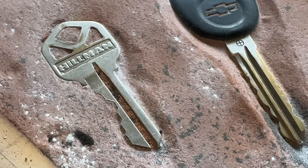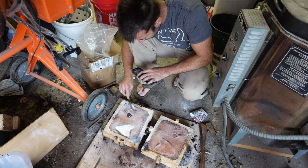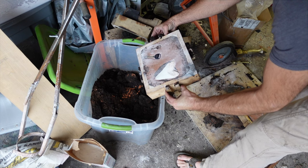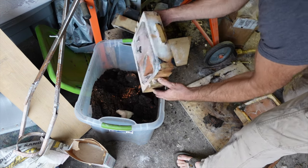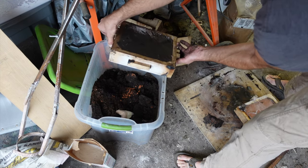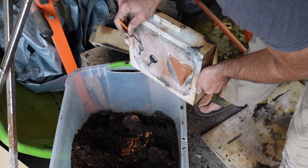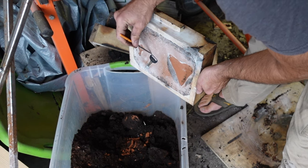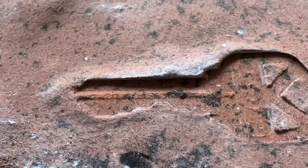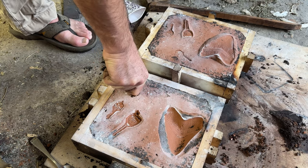You can see that the sand didn't pull cleanly from the key's main groove — that's gonna be a problem. I'll tap on the keys to try to loosen them a little bit and then dump them out to see what the other side looks like. They're pretty light so they don't want to just fall out on their own; I'll have to extract them myself. The sand pulled away from the other side too — it's not going so well. I'm gonna keep going and see how we need to modify this as we continue.